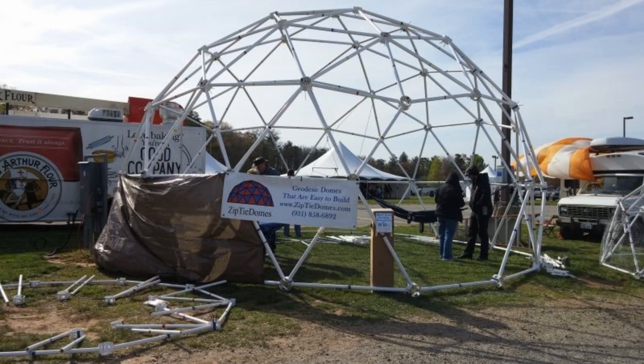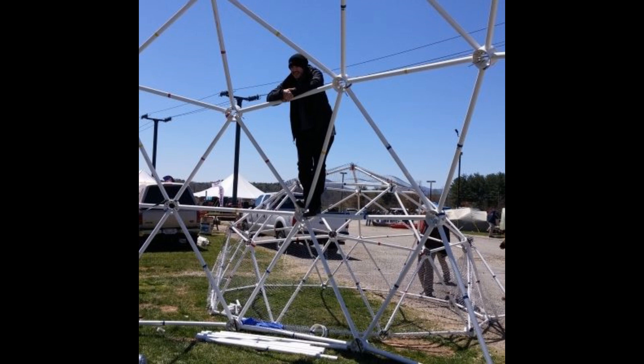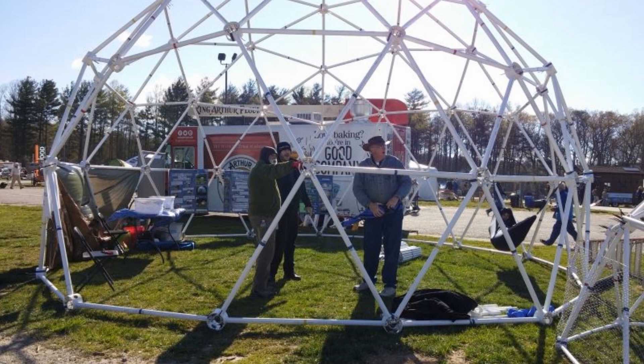To make a larger entrance for the fair, we removed an entire hexagonal section of the dome, and yet the dome will still be strong enough for a swing chair or climbing. To maintain the dome's strength with a single opening, you have to keep the foundation ring intact and not remove the strut at the bottom of the doorway. Otherwise, the dome will spread out and not be as strong.